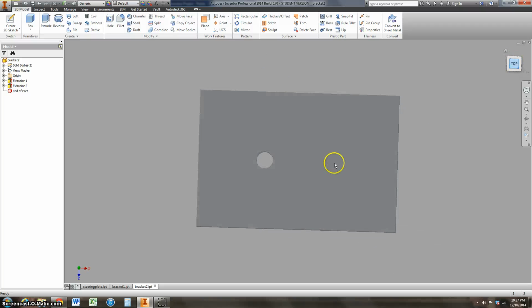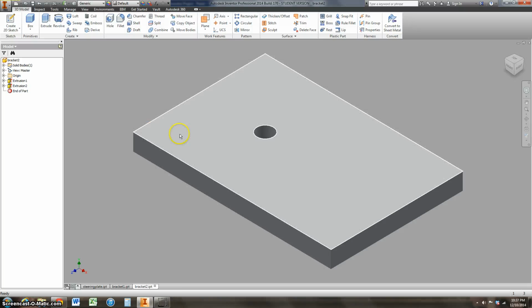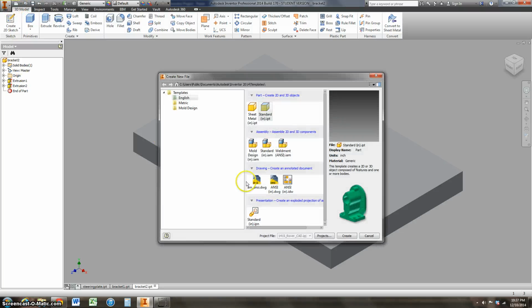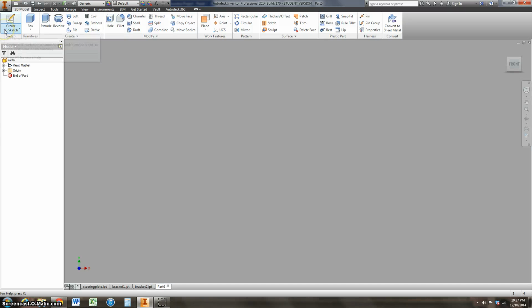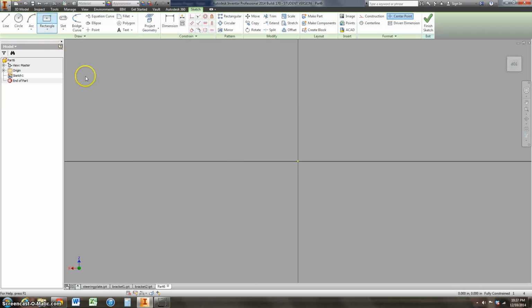I can click on the top view. You can see that that hole goes all the way through. And let me go ahead and save that. I think there's actually one more little bracket off the steering bar that we have to create. And once you know how to do these, it goes this quick. This was just a little 3/16 inch piece of flat rod. And I think this was just 3/4 of an inch wide. Maybe 1.5 inches long.